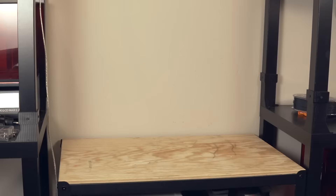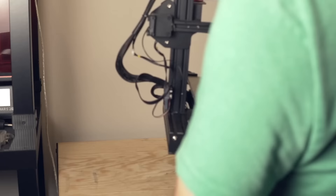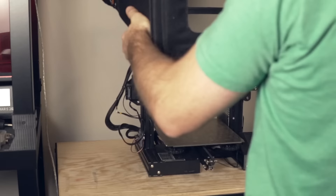You're also definitely going to want an enclosure. You can get away with printing some small pieces if you've got the printer in a closet or confined space, but anything of size will cause delamination or cracking amongst the layers. I've got the Wham Bam Hotbox, which is an awesome portable enclosure I just quickly pop up when I need it, throw it on top of my Ender 3, and unzip two zippers to store it away when done. There are other options too — acrylic enclosures, DIY foam board builds, and all sorts of things.